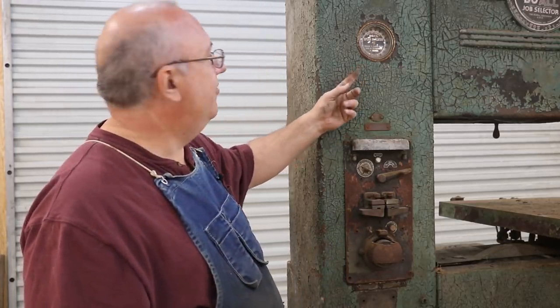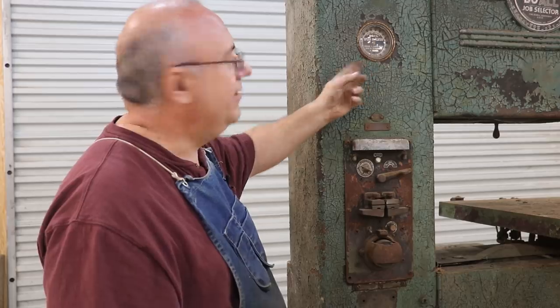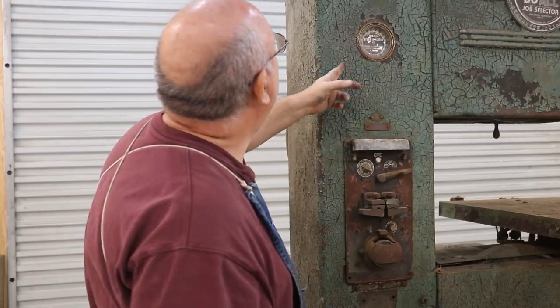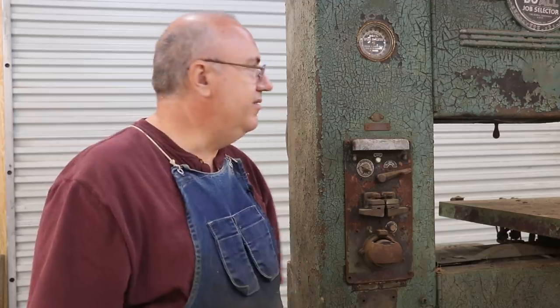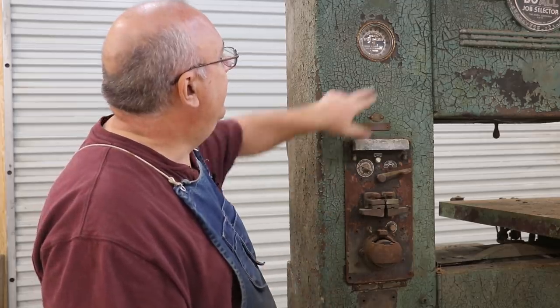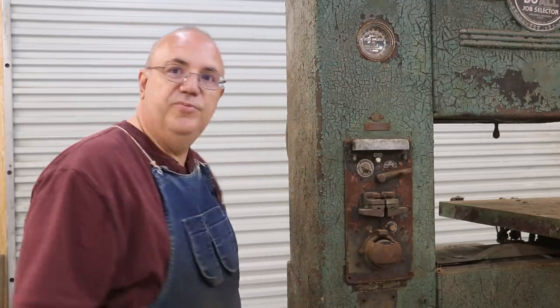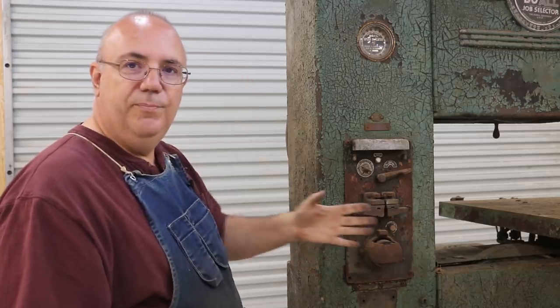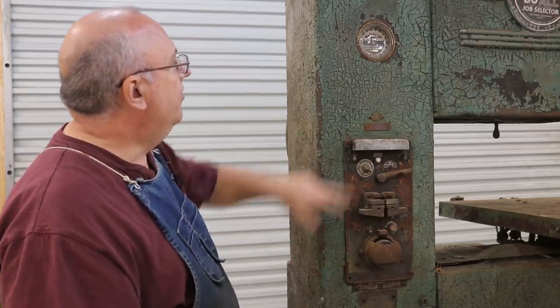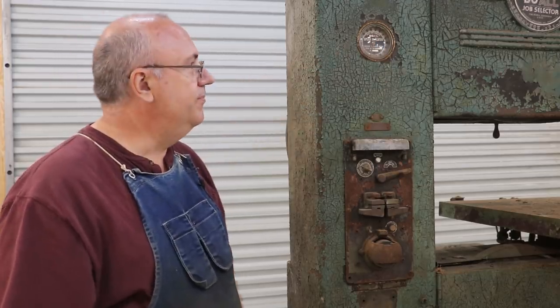It also has right up here this really neat speed indicator — it's basically a tachometer. It's calibrated to tell you the surface feet per minute that your bandsaw blade is going by, which is what's important. You're not so much worried about RPMs; you're worried about the speed of the blade in feet per minute. You would adjust that based on the type of material you're cutting and the type of blade you have. This is a variable speed machine with a high range and low range in the transmission, and it has a Reeves pulley where the belts automatically adjust when you crank on the side to speed up or slow down.